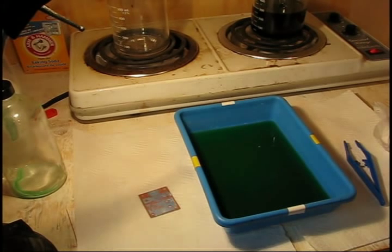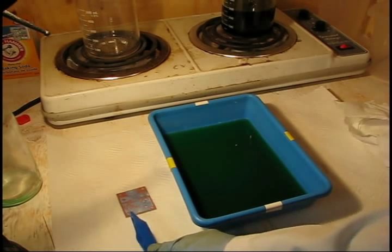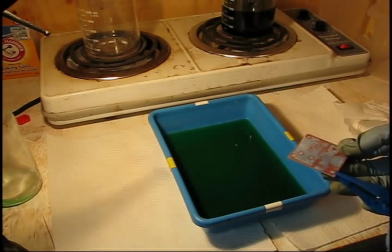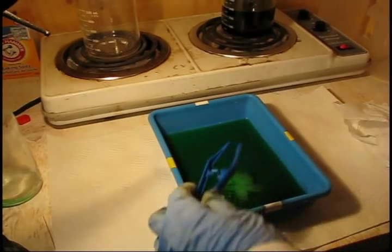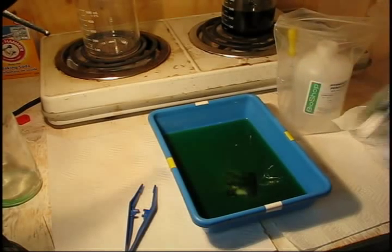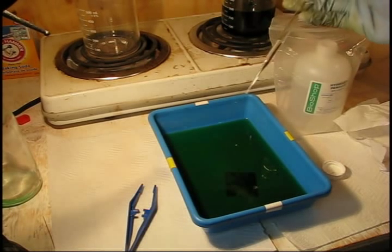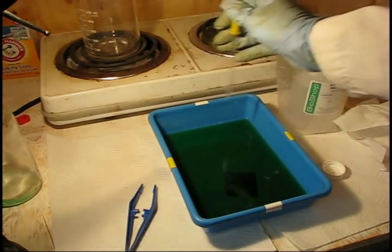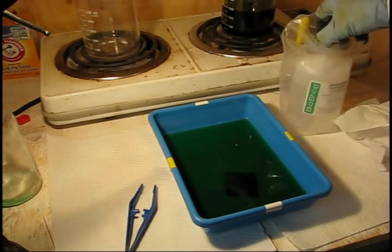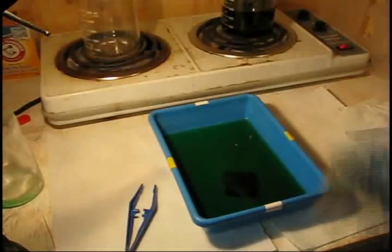If you have sensitive lungs you can add some ventilation or do this outdoors. The fumes aren't terribly harmful if you have a weak acid mixture, but when you initially make your etchant it will be pretty strong and you don't want to breathe any of it. Clip the board in your tweezers and carefully place it in, then set the tweezers aside. Once the board is in the etchant, add a tiny amount of hydrogen peroxide — 30% is very strong so you want maybe even half a milliliter — and place it far away from the board. You don't want to place it directly onto the copper board, as it will corrode the copper even through the toner mask, and you don't want to add too much hydrogen peroxide either, otherwise you may produce chlorine gas.